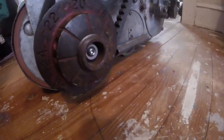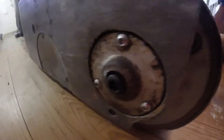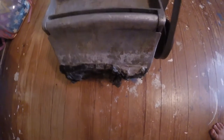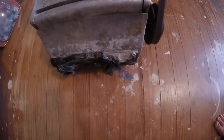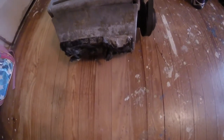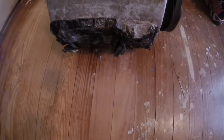So, put it in the machine and see how it works. You can't really see too much of it, but here's the piece that was broke off on the right-hand side in the last shot. That pulley goes through the drum, and on the other side there's a fastener just to hold everything together. Just doing a quick test run here — you can see to the left I kind of already did a test; forgot to have the camera rolling. The sander still needs a little bit of adjustments — height of the belt and speed of the pulley, which is adjustable, which is pretty good.